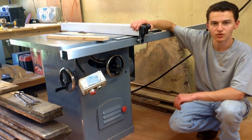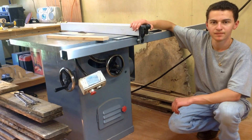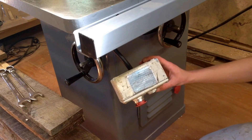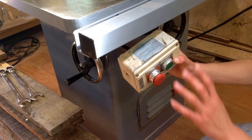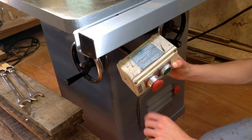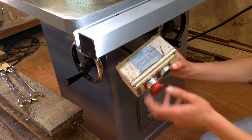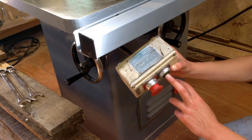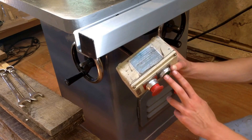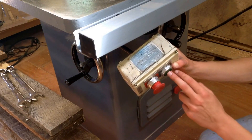I've had some minor issues electrically. The first problem is the switch — this is a switch a neighbor of ours gave us. It's one of the type where you ratchet the stop to make it run, and it does not want to start the saw. Now, the saw does have a magnetic starter that came with it; I believe it is factory and no one installed it.